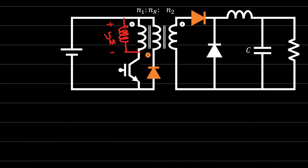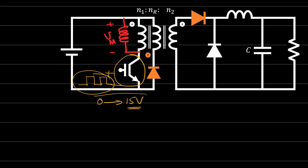We place the transistor on the primary side to achieve a simple gate driver design. We simply generate a gate voltage from 0 to 15 volts, for example, without needing to account for the voltage potential at the switch node. If the transistor were placed on the other side, we would need to ensure 15 volts from gate to source relative to a floating potential, resulting in a more complicated gate driver. In this configuration, the reference is common to the input source ground — zero volts — so there is no problem.